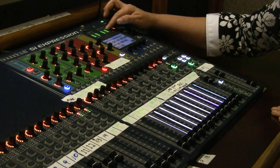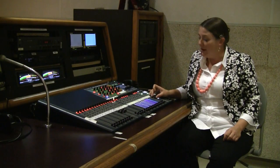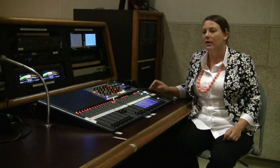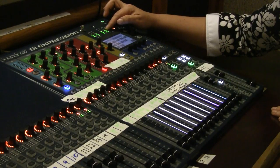As I'm calibrating the tone, I'm going to adjust my faders so that the one kilohertz tone is registering at negative 12 decibels on the digital audio board.